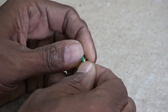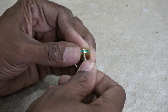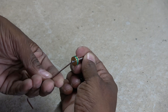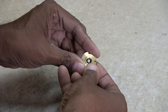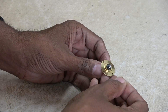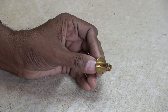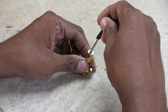Next is a piston assembly, which needs an o-ring seal installed. The manual calls out which screws need to be thread locked, so be sure to pay attention. This particular screw was a bit fiddly to get started, but persistence paid off.